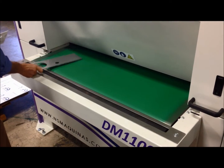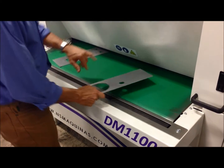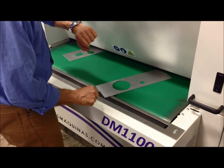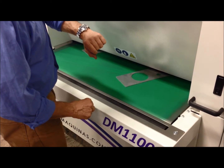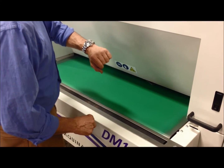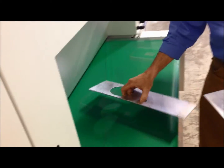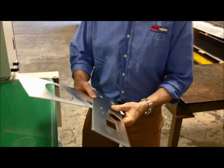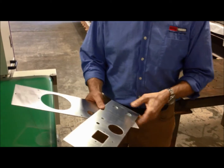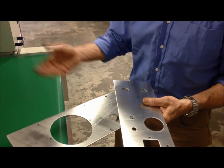At the same time I'm going to gauge how many parts we can do here. You can place about one, two, three, four parts across. As we run this I'm going to take the time — that is about five seconds, then seven, eight seconds. At eight seconds per set, four parts across, we are making — in 60 seconds — about seven behind each other times four across, which is 28.